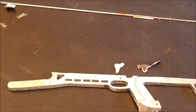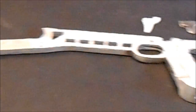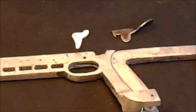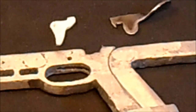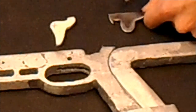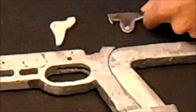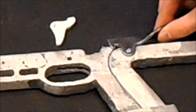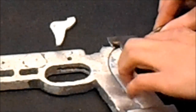Here is what we had from the end of Part 1. I also have out a piece of 3/16 inch mild steel rod. We're going to be using the rod to make pins for the mechanical parts — all the things that have to pivot. We have to drill a 3/16 inch hole, or whatever size metal dowel you're using. Drill a hole in the base of that latch for it to pivot, and also in the aluminum where it has to mount.